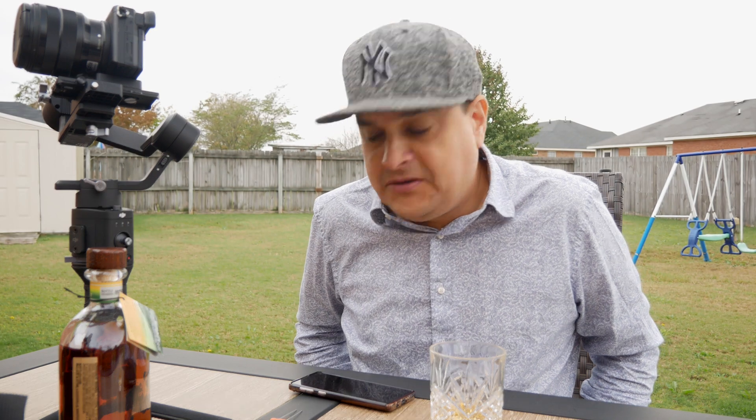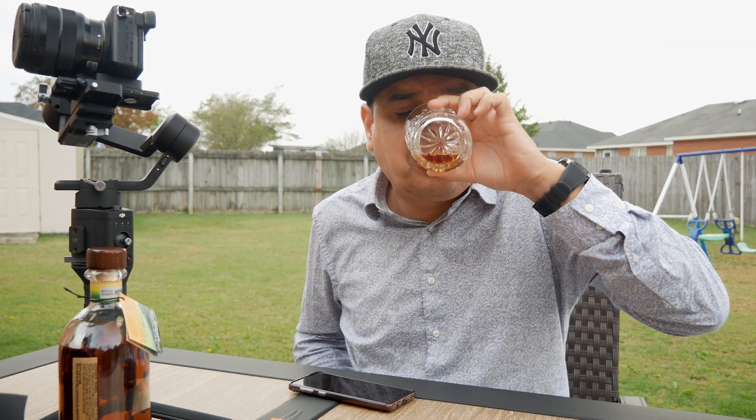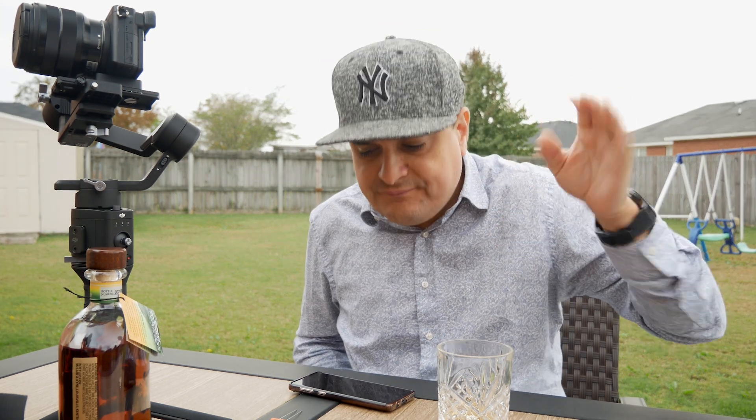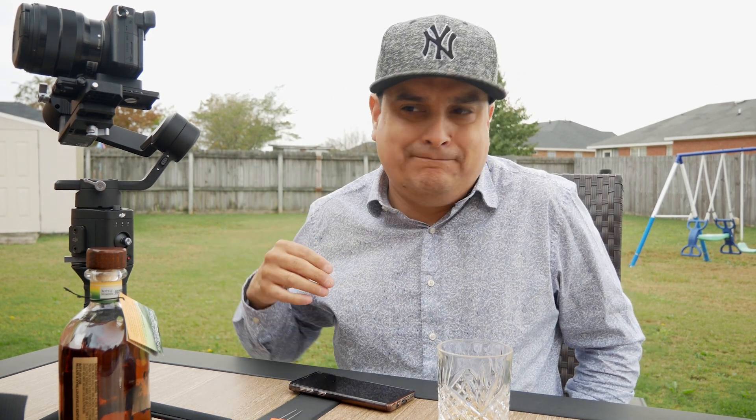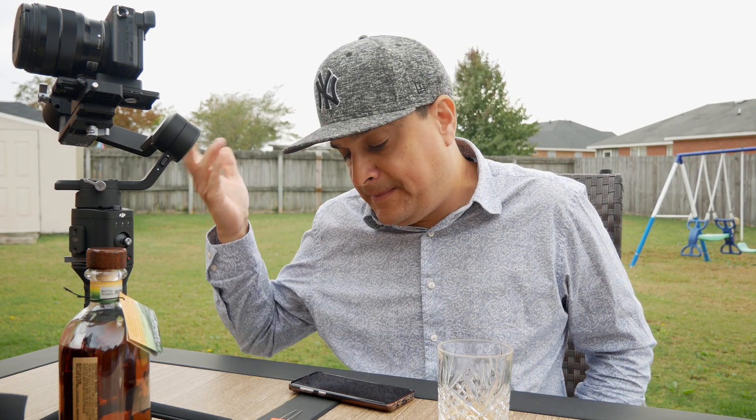So to recap: the top line is basically branding and voltage, which doesn't matter as long as it's above about one volt in a guitar. The bottom line: the first two numbers are the value, the third number is how many zeros you add in picofarads — play with the multipliers or Google the conversion — and then the letter is tolerance and the last four digits are the date code. This is somewhat specific to manufacturers, and very old caps may not follow these standards exactly, but once you understand the standard you'll know what you're looking at.